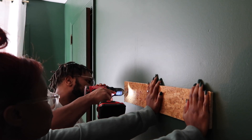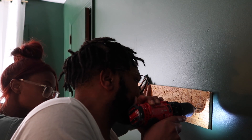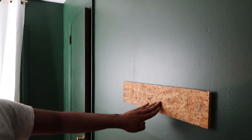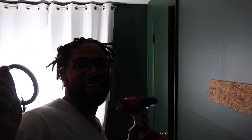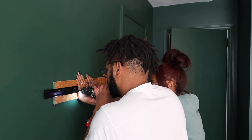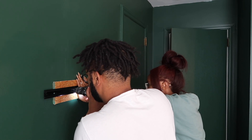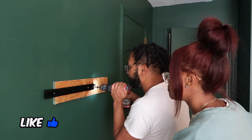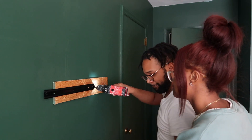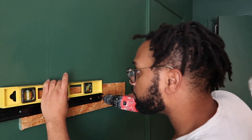I want to thank my understudy carpenter for helping me hold this plywood up. You can use drywall anchors — the TV mount came with them in a kit — but I just didn't trust it. I preferred to actually be in the studs; I feel like it's more sturdy. Once you put that back plate into the plywood, you have the full support of those studs within the wall. It could have been made a little longer, but it doesn't really make a difference because it's not shaking or moving at all.